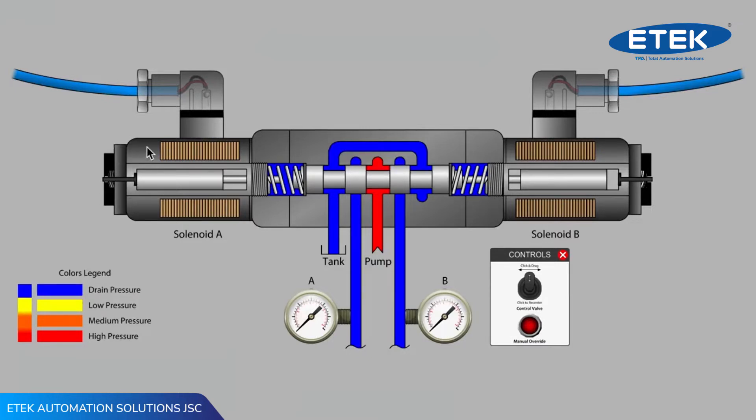It is typical to find a coil of wire on each end of a three-position directional control valve. The coil of wire, together with the valve tube that contains an armature and a push pin, make up what is known as a solenoid.